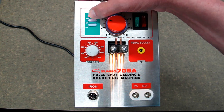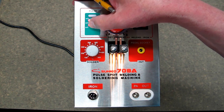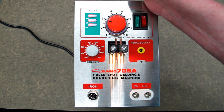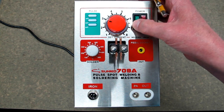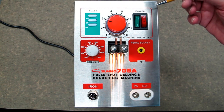You can combine settings: turn on 4 and 6 to get 10, or 6 and 8 to get 14, or all three to get a pulse duration of 18. If you turn the switch off and back on, you have to reset these — that's kind of a safety factor.